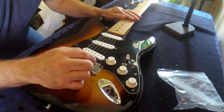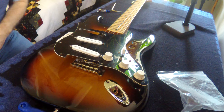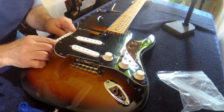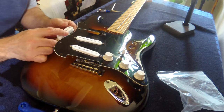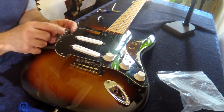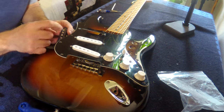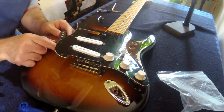As you can see, I've had it partially apart here. I was going to try to move the pole pieces with the pickups in the guard. But on these cheap pickups, they have the two magnets on the bottom, which you can break loose when you're doing stuff like this, because the poles are between them and you can easily knock these guys off.